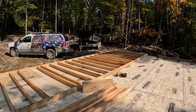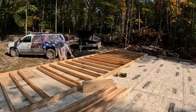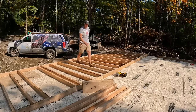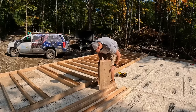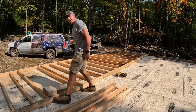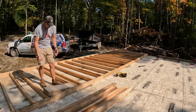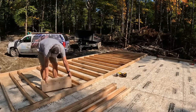Are you all done, Stevie? Yeah, I'm all done. Want to stand her up? No, will you put that header in, Stevie? Header going in? Yeah. Which way do you want it, Donnie? The 2x4 down or up? Down, right? Point it down. So go right to the top? Yeah, and then you can nail down through that top 2x4 into the header. It goes right to the header? Yeah. Sweet. That header's never going anywhere.